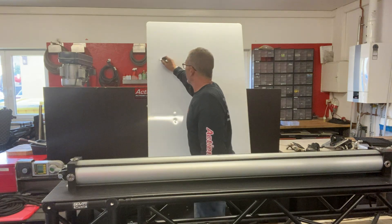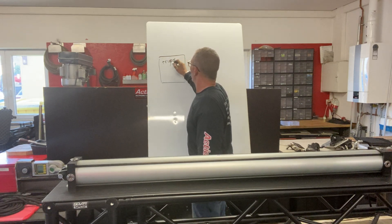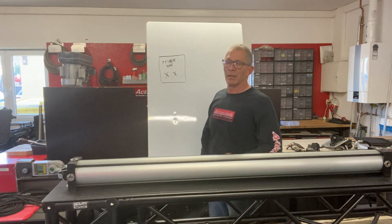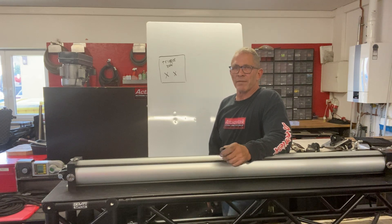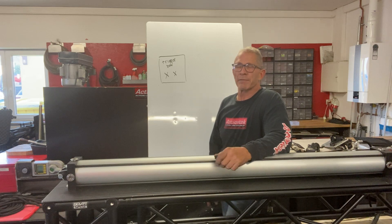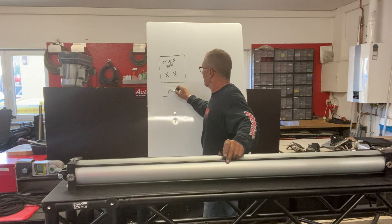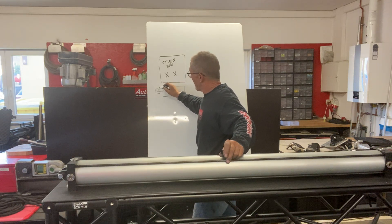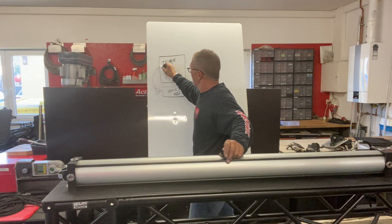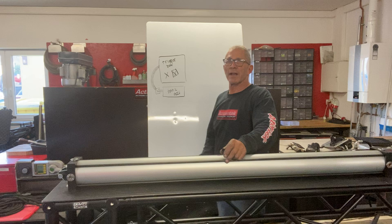You're always going to have some form of trigger box. This trigger box will usually have two valves or one valve that works two ways — I prefer two valves. There are a million different valves, but the reason I make what I make is that they're the fastest and highest flowing, which makes a big difference in operating pressures. You're going to have a valve, you're going to have an accumulator — which is a tank — plumbed usually through a manual valve into your trigger box. That's how you get air into the box.